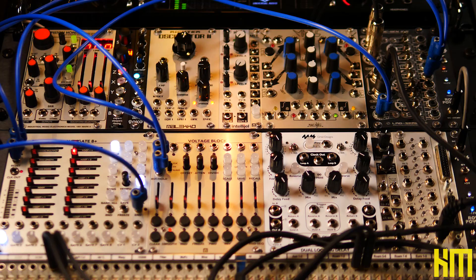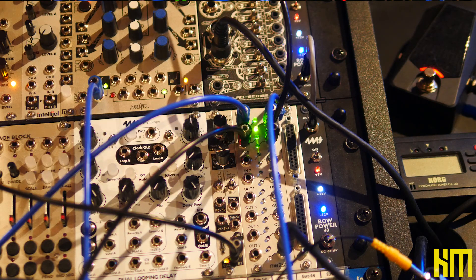Another great example where I'm using active electronics in my studio is my little Eurorack rig. All of the signals that unit generates are unbalanced, but I've got an amazing little balancing IO — an active unit — that allows me to send directly out of my console into my Eurorack and come back with no weird impedance mismatches. And of course, that's available on my patch bay, which gives me even more flexibility with those Eurorack signals.